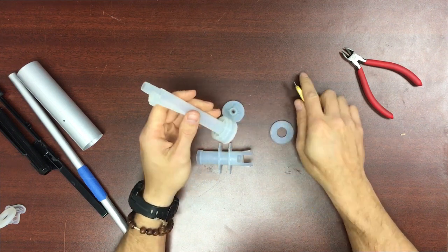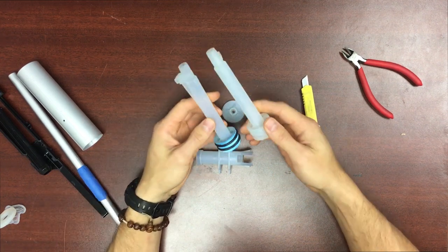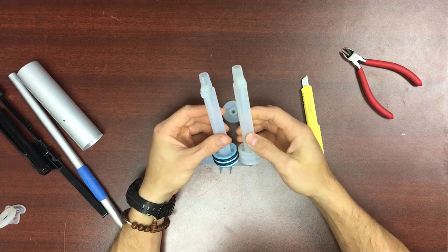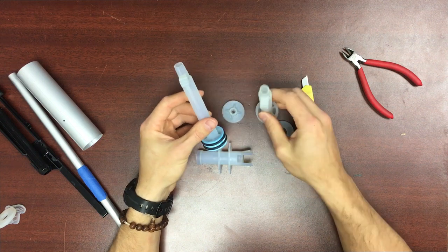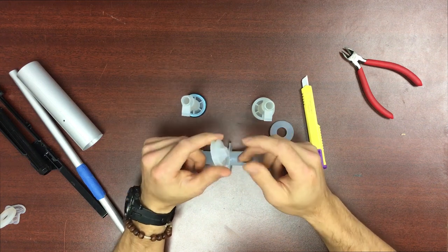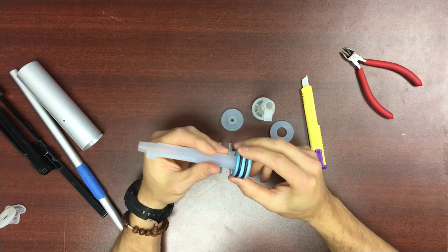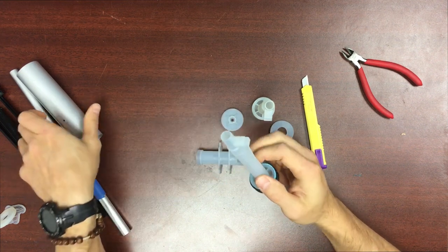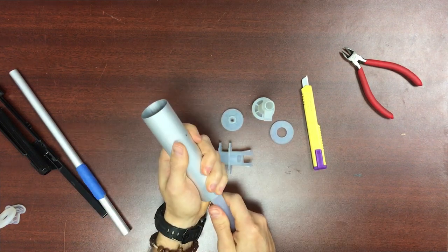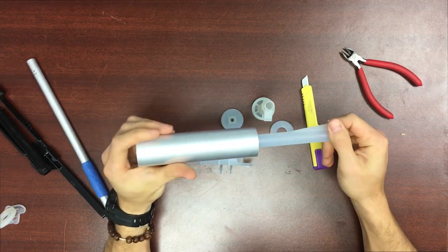The breech uses a dual o-ring setup. I have a finished one here — I put some teflon tape on this one because I was just experimenting with fit. You want to have high friction with this part and low friction with the plunger head, because this needs to move as fast as possible while this needs to have an incredibly good seal with the front of the plunger body. This is ungreased so it won't be that hard when you install it for real.